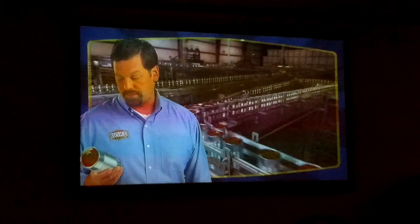Now, they're ready to be sent out into the world. We gather them into cases of 12, and then a tray slides in, and it's actually formed underneath the can. Then we shrink wrap every case to keep the cans clean, but it also stabilizes them for shipping. And here comes my favorite part. This is the palletizing machine. It stacks up those cases like bricks, changing the orientation of the cans for stability. Once the pallet gets wrapped, it leaves the cage, and a barcode is pasted on the side of the pallet.